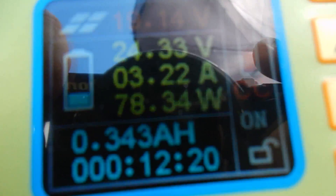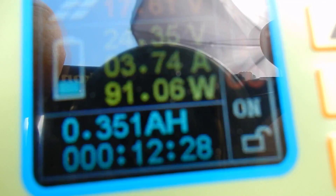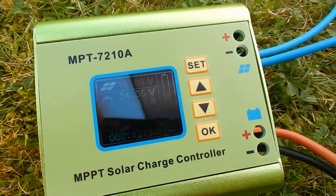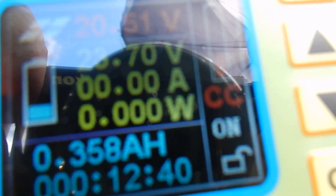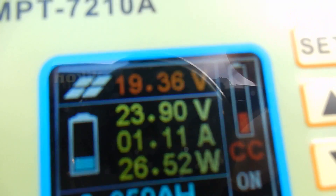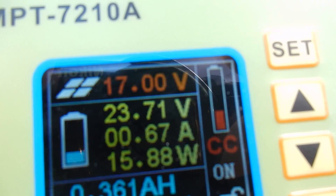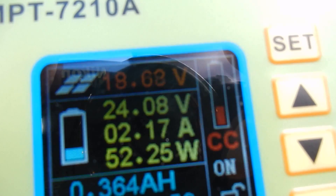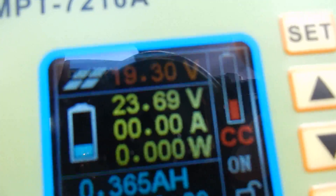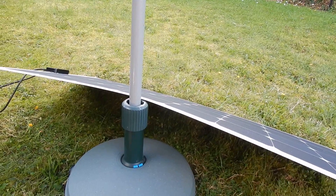The sun's come out. The display is a little hard to focus on, but we're getting 88 to 90 watts reported — and that's creeping up. Of course that's battery watts, and this charge controller has some inefficiency, so it won't tell me the exact solar panel watts. I think the best approach is to measure the solar panel volts — shown in orange at the top — which settles at about 17 volts, the panel's maximum power voltage, and then read the current with the clamp meter clamped over one of the cables from the solar panel.